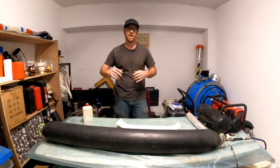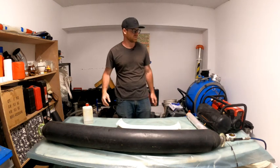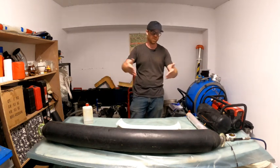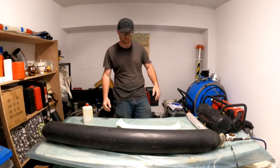As we inflate, there are a couple of things we're checking — we're making sure there are no leaks and that our packer is working properly and won't pop during the repair. Things can still happen, but we want to mitigate that. Looks like we're golden over here.